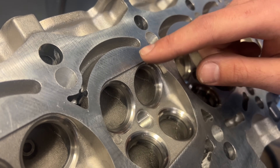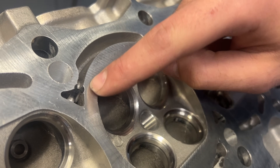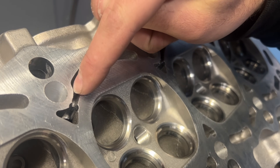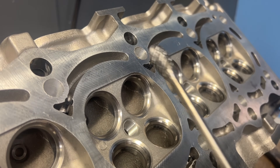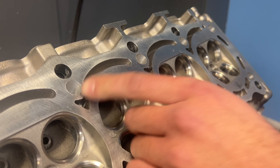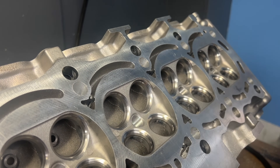In here is the most important part to be welded up. You see how this water jacket goes around the chamber right before it actually enters the block — we're going to come in and take out all of this material in here to make sure that's actually sealed up before we close up anything else on the deck.